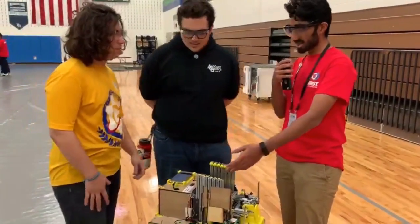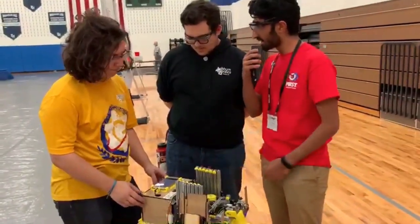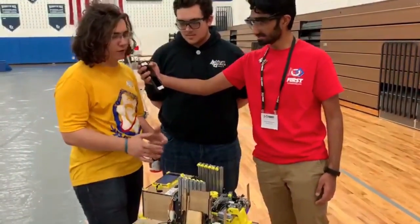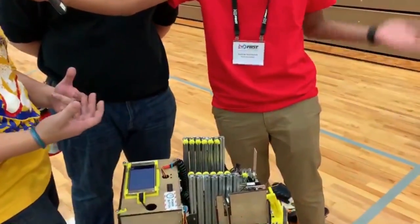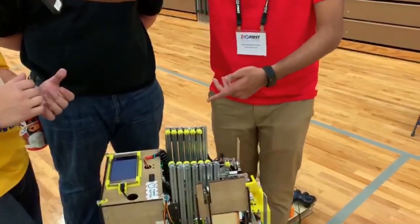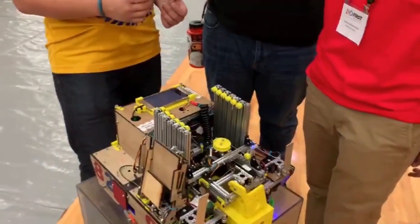Let's go with your vertical slides. You guys have a really nice system of vertical slides — I see a lot of slides on there. We have a two-part, seven-stage lift where the whole system can move up and down and also in and out. This helps us take the blocks from inside the robot and into the foundation. The whole system is powered with one motor, which makes it a lot easier for maintenance or if we need to make an adjustment.